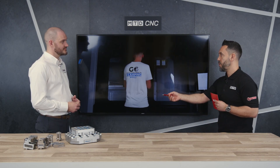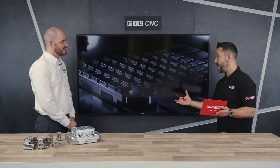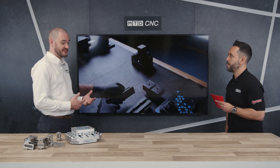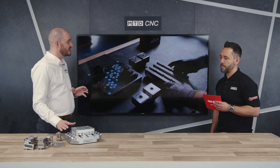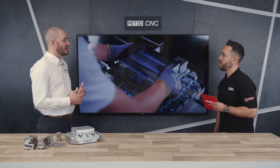Let's move on to fourth-axis or horizontal machines and multi-pallet machines. For fourth and fifth axis there are different pallets available compared to the standard three-axis base plate. Also worth noting: what we've seen on screen and what's on the table here is the 50 mm pitch. If you don't need that many zero points, the 100 mm pitch is available as well. We can also do tombstones — flat base plates with pneumatic receivers — so if you want automation available, it can absolutely be done, with a pull-stud zero-point incorporated into the tombstone.